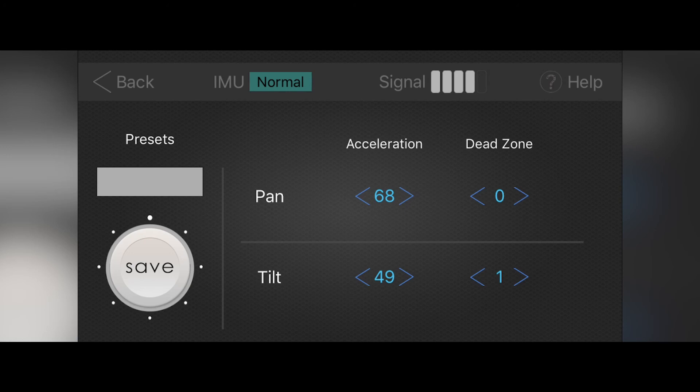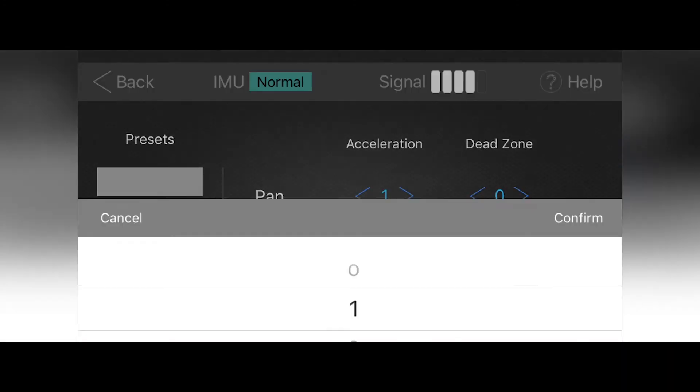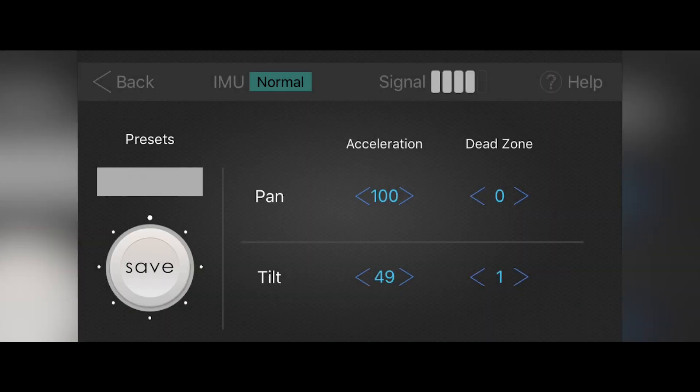The next item is acceleration, which is linked to stiffness and speed from the previous menu. If you have stiffness and speed set really high with a high acceleration, you'll have a high and fast response. A low acceleration gives you a slow but very responsive motion. With acceleration set to 1 but high torque and high stiffness, the acceleration is still very low even though the response is fairly responsive. With high torque, high speed, and high acceleration, you'll have a very responsive and very quick response to all your hand movements.